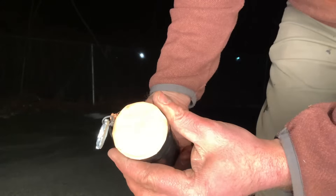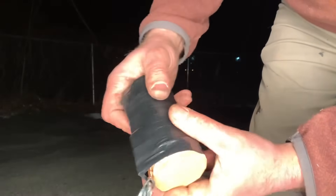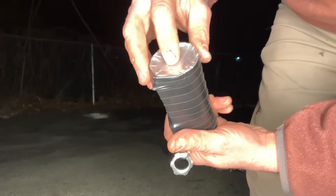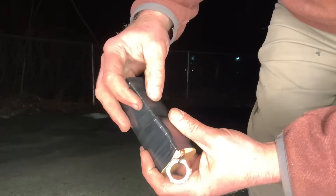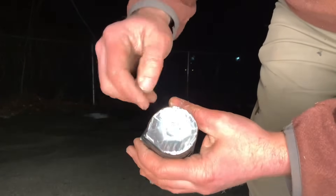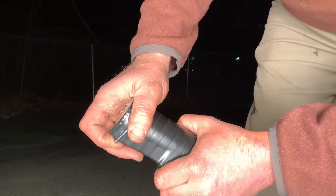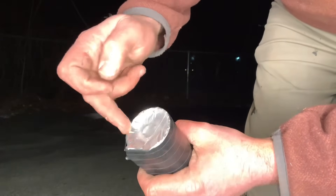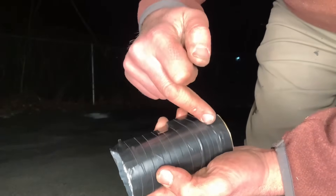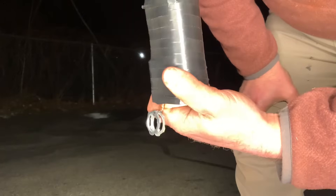This is a paper mailing tube, about two-and-a-quarter inch internal diameter. I put a plaster bottom and a plaster top on it. I compressed the mixture until it was solid with an arbor press — though it was just enough to crush the bottom of the tube. It's bored out in the center. There's a time fuse, roughly seven to ten seconds for all three of them. There's a pull-string igniter that ignites a fuse primed with a one-to-one ratio of antimony trisulfide to potassium chlorate mixed in nitrocellulose lacquer. That fast-burning Visco fuse runs down into the bottom, so it ignites the bottom of the device first. We're going to test this out — if it's awesome I'll make a dedicated video.